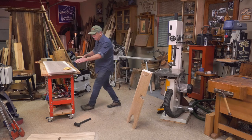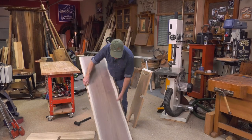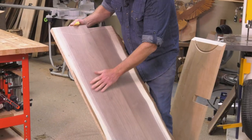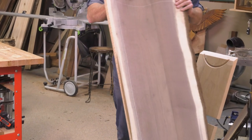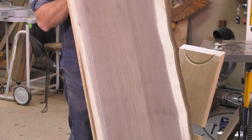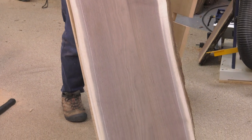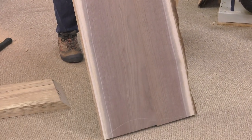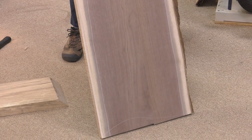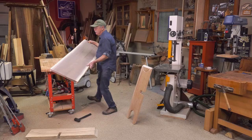The other thing that I've done right here, take a look at the glue up. I worked with it a bit. Find the joint. Where's the gap? It's perfect. It just blends together, the grain, the color, everything's right about it. Now I laid in a line here that's curved and a line on the other end that's curved, and I'll use a bandsaw for that too.